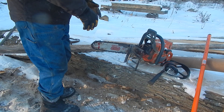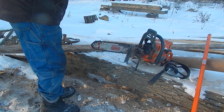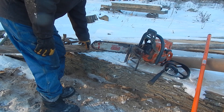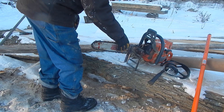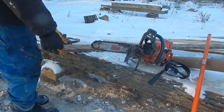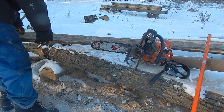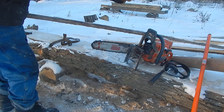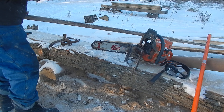This one is wide enough I can get two seven-by-seven beams out of it. The seven-by-seven is because the two-by-six isn't really six inches — they're a little under. But on the hewing guide you're running an offset because it runs right on that, so you end up with about seven-by-seven. When I nail them on I can put maybe three nails in and that works fine when I'm working on the bark side, but sometimes seven or eight nails to keep it stable and centered.